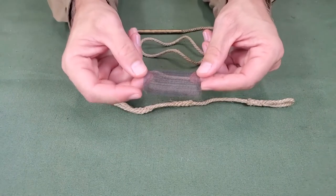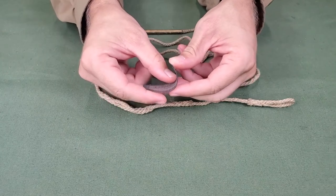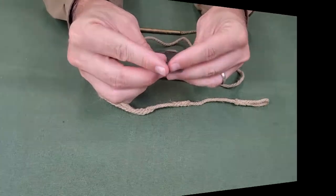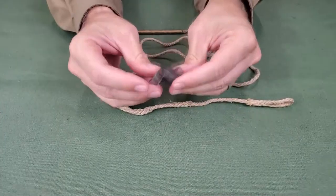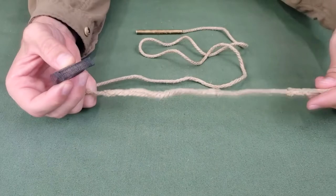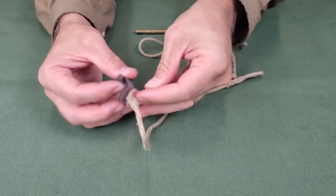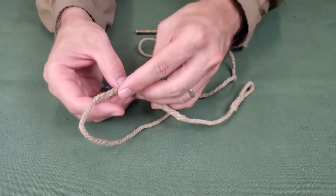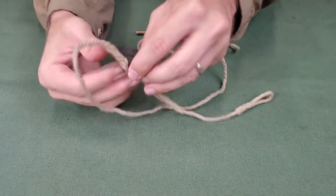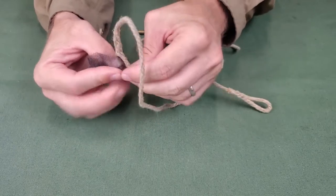A new piece of wire gauze will need to be fitted to the pull through. To fit it, fold it so the longer sides take the shape of an S. Open the loop of the pull through nearest to the weight and put one side of it in each loop of the S. Coil each half of the wire gauze tightly around the cord until the two rolls thus formed meet.